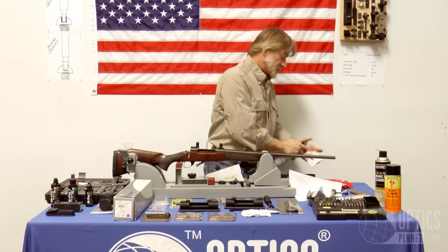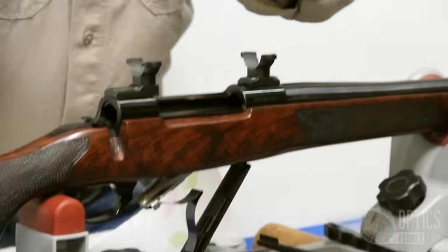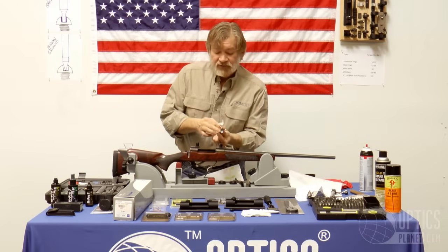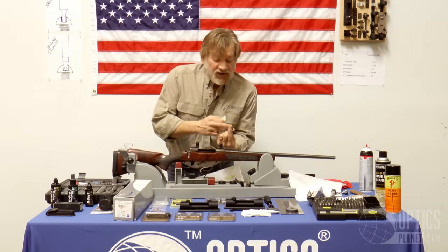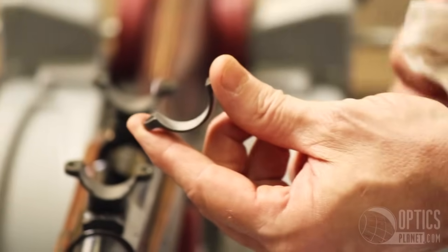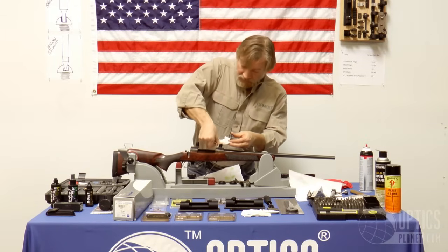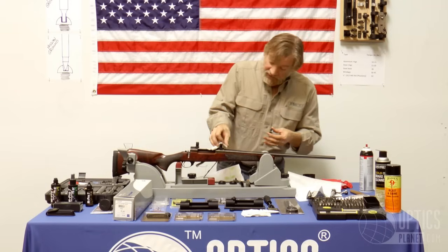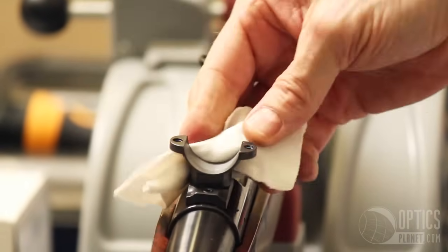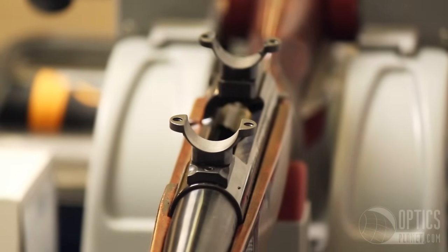Here's my gun scrubber. When we started, that ring was this color all the way around. Now, it is this color. You could see how burnished it is. You could see about 85% of all of this surface area has been completely smoothed out. Not only the top ring, but the bottom ring. And what's neat about those little scratches, again, is that you know how to orient that ring back in the exact same place where you just polished it up.